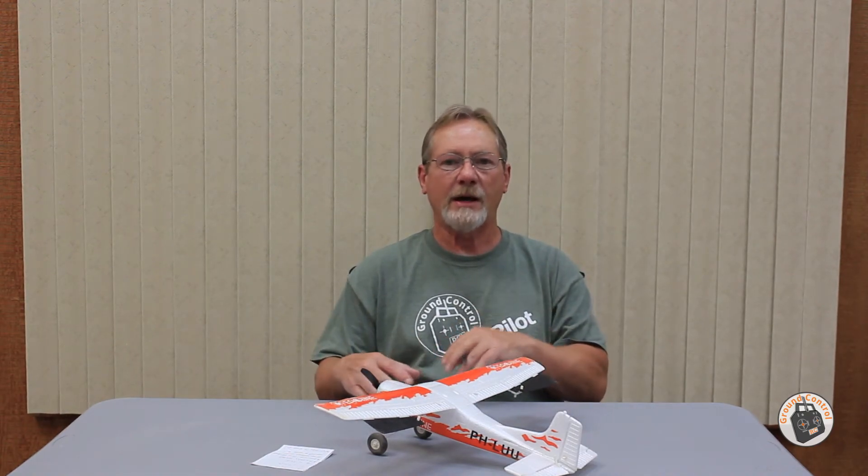When I connected, I had my transmitter set up and turned on and bound to the receiver while testing the gyro. I then unplugged the LiPo, took it over to the computer, and hooked it up to the config tool — but I forgot I'd left my transmitter on. As soon as the USB port powered the receiver back up, it immediately bound to my transmitter, and I couldn't connect to the receiver in the software. So if the transmitter is left on and you connect your receiver to the config tool, as soon as you power it via USB it's going to bind back up to the transmitter, and the configuration software can't connect. I just discovered that by accident.